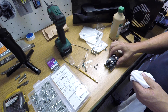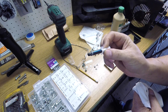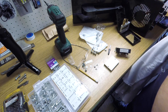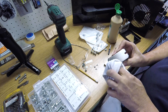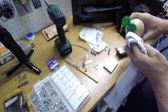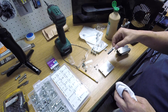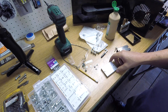To mount this heat sink on the rectifier, I'm going to use what they call thermal paste — just a small tube with a little applicator syringe, used for computer work, mounting heat sinks on CPUs and that sort of thing. I've never used it before and I honestly don't know if it's a necessity or not, but I'm going to clean the heat sink on the rectifier with some alcohol and clean the heat sink itself. I'm not sure if this thermal grease, or thermal paste, has any adhesion properties, but just in case, I'm going to clean that up.